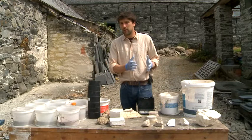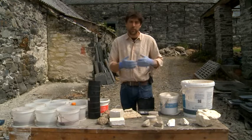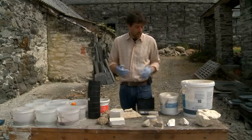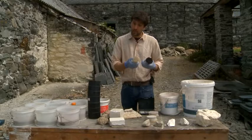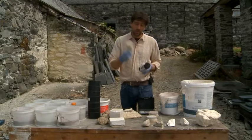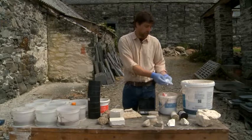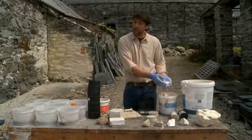If we were to make an internal plaster for traditional three-coat work to go over laths, or even externally for renders, it's always a good idea when you're mixing sand with lime to add some hair. Traditionally horse hair or goat hair was used, and today we use plastic fibres — polypropylene fibres that you just throw into the mix, and they're much finer and they mix far easier in the mixer.